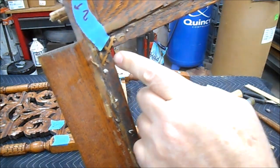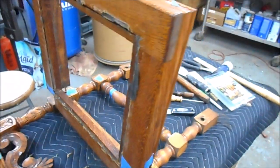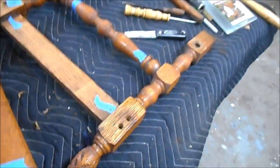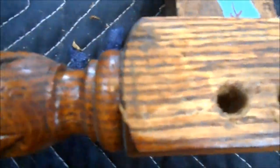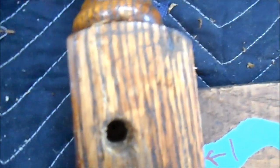It was a cane seat at one time. Okay, a couple of things. When you pull off the chair assembly, as I showed you when I first got it off, we have the dowels that go into those holes right there. But if you look behind there under all that glue, you can see broken dowels, two of them in fact. But there's no matching dowel holes on the back leg assembly.